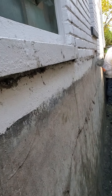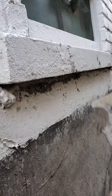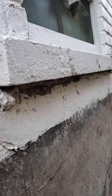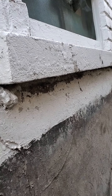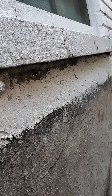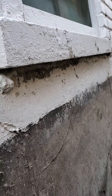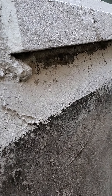One more thing: don't let the concrete guys screw up any of what we do along the top here. If they screw it up, any leaking is on them. They can't use re-rod into the house because that's going to cause openings and you're going to leak again. I've seen some concrete guys do that — just a heads up.